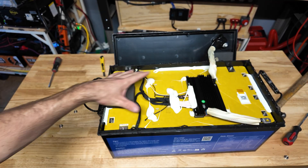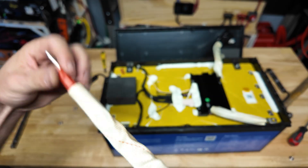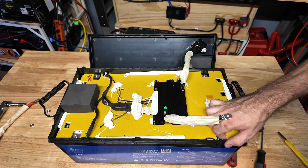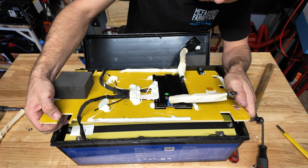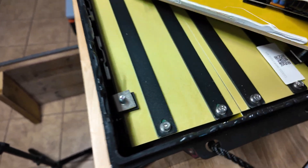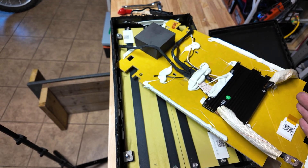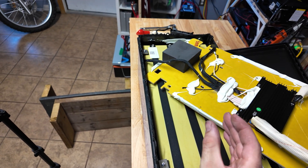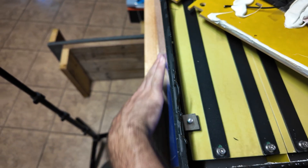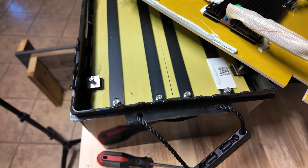I pulled all the cables off the main studs. Here's the crossover wire — really nice quality crimp, heat shrink, thick lugs, and what feels like about 4-gauge wire. The fiberglass sheet is about five millimeters thick. The entire cell assembly is encased in a metal frame, which I love to see — it makes the battery very structurally strong. The cell terminals are on the inner-facing sides of each cell, with all the wiring, balance harness, and bus bars along those faces. I'm assuming the bus bars are all laser welded — eight cells on each side giving you 16S for 48 volts.